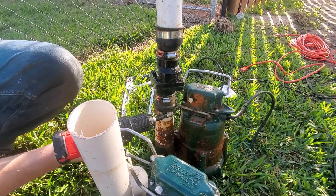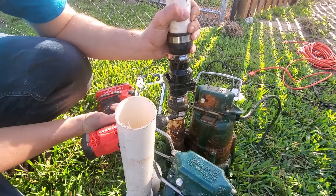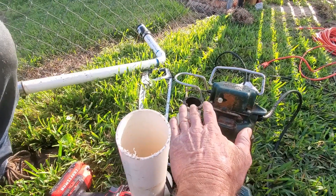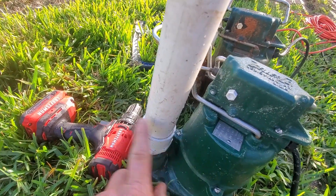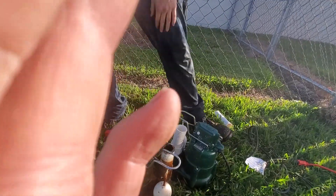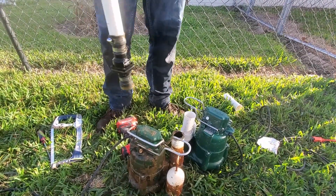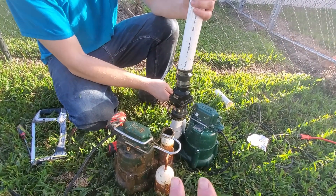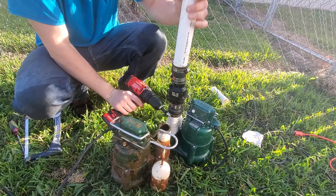So what we want to do is take off this bottom clamp right here, then we'll make that same measurement of pipe on this one and put it all back together. Use your handy-dandy Black and Decker or whatever you've got — loosen that up and pull that check valve right up off of there. That simple. There's a lot of crud in here — this is real normal, just debris and sand that's been coming through the line. Looks real good. We're going to make that measurement over here onto this pipe, cut it off, and then put it all back together. Put it back in the pit and we're all done. Make your measurement, transfer the measurement — you can see they're pretty close. There can be some difference since we do have a no-hub, which is actually the check valve. Now we're going to set the check valve in place and retighten up that bottom clamp — we'll tighten them all up to be safe. It doesn't really matter which way it's turning because we can set that pump at any direction down into the basin itself. Tighten up all the clamps starting with this bottom one, make sure it's as tight as it can get.